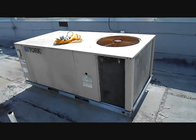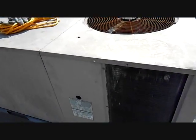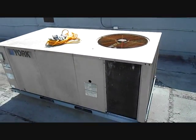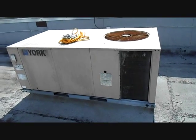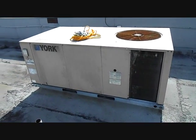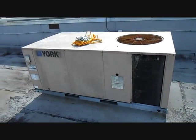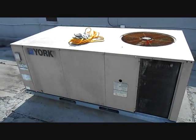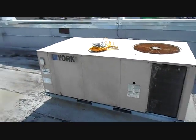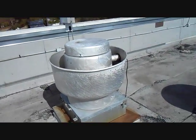The old York is all squared away now — it's got a new Danfoss three-phase scroll compressor in there, sounds good, running on AC right now. It looks like a York sun line unit, maybe a five-ton straight cool with electric heat, about 12–13 kW at 208V. All done here — got a phase monitor mounted inside the panel, indicating no fault right now, which is great. We're all done for today, about to leave McDonald's and go home. If you looked inside there, you would never want to eat at McDonald's again.